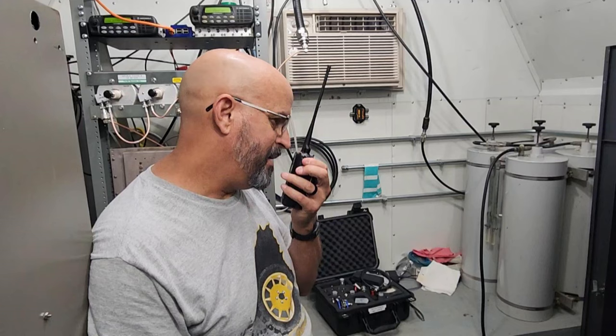We were really happy with finally figuring out what was causing the problem, and we would not have suspected the amplifier — that's why it was the last thing that we checked. You can see here with Mike testing that we've got the original cans back in place. We didn't need the ones that we had done a quick tune job on, so we put the original ones back in. I drove back down to my property, which is over 50 miles away, and was able to get into the repeater, fully copyable, even at 20 watts without the aid of the amplifier.